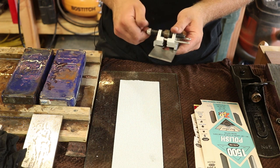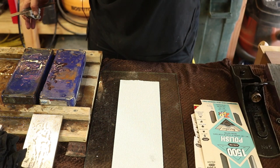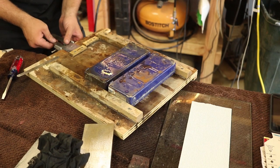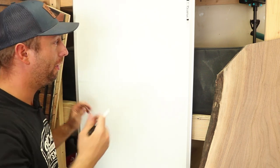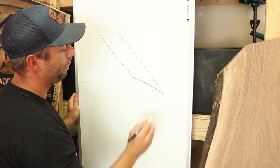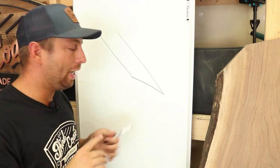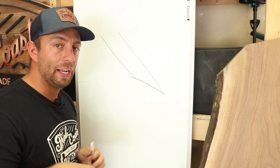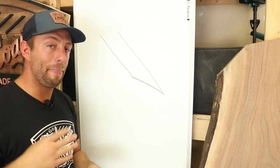What I'm going to do is put it in this guide. These are super cheap — I get these for like seven dollars. Over on my sharpening table I have these numbers — this side is for plane blades. I'll set my bevel to 25 degrees. I want to explain why I'm sharpening at 25 degrees. This is when I get a new blade and don't know what angle it was before, or maybe every six months or every year I'll go back to square one again.